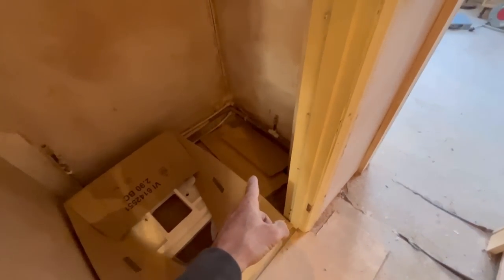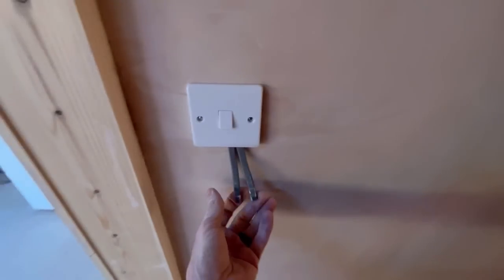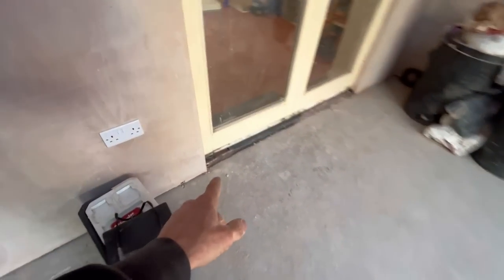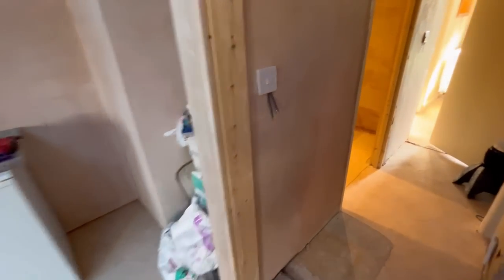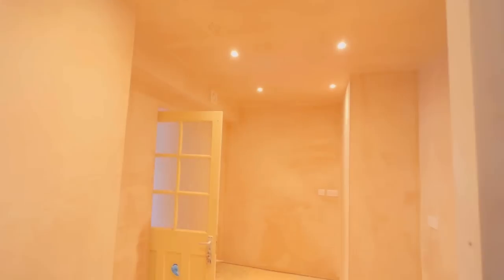End of the day then. Holes all dug out, you've already seen, and that's ready for concrete tomorrow. We have lights all connected in the hallway in there now. These aren't live, these are just feeds. I've already said these go to these cables over there and they're not connected to anything yet. So we've just done that for now because behind the socket is live. Likewise with these, they aren't connected, but one of those is to allow for these lights to go on and off.